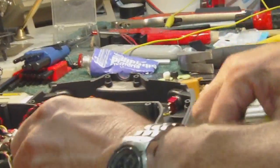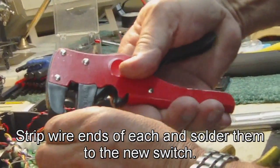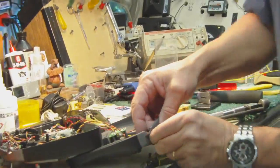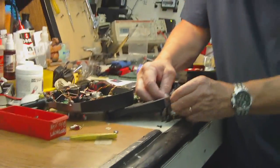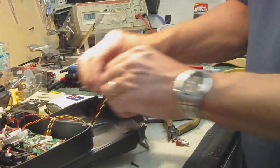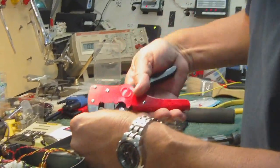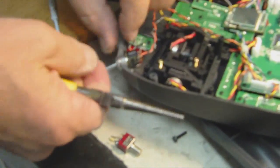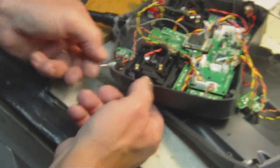Okay, fix that and strip these wires. Over here is the switch that's broken. Lesson number one: don't drop your transmitter — that's on page six, I wrote that down, just another lesson. Okay, we'll strip these wires, get the soldering iron out, tin them, and put on a new switch. Okay, solder the wires on.